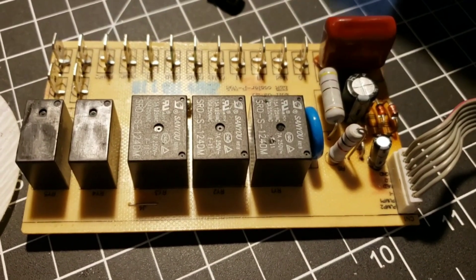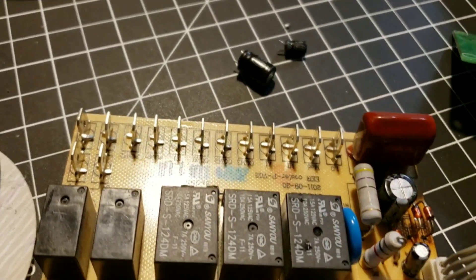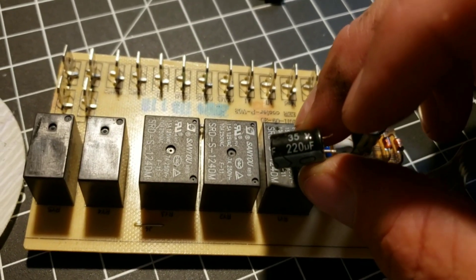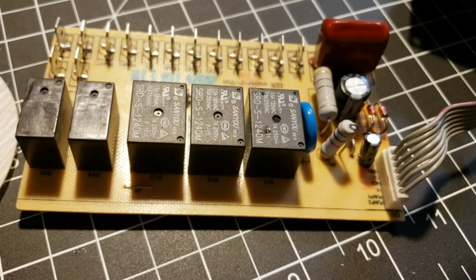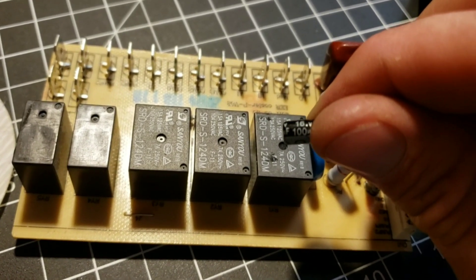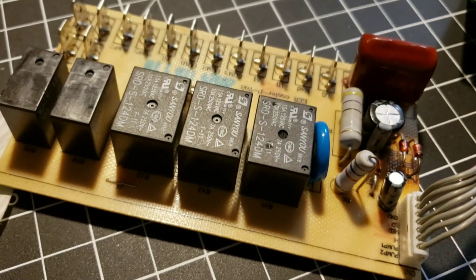After a whole lot of fun, it turned out that these two black capacitors right here were both bad — that was the problem. Here are the old ones. I upped the voltage rating on the new ones. This one was 35 volts and I made it 50 volts; it was reading at like 0.5 — pretty bad. This other one was 16 volts and I upped it to 35 or 25 volts; instead of 100, it was reading like 0.05 — really bad. Everything's working good now. If you have this problem, pull these two capacitors out, test them, put new ones in — cost you like 20 cents.